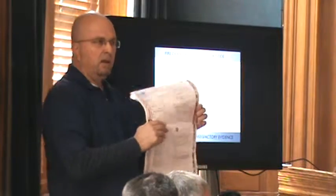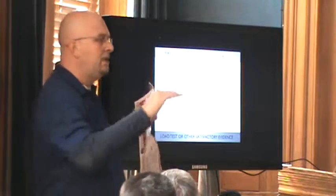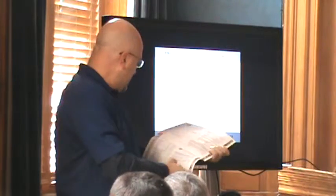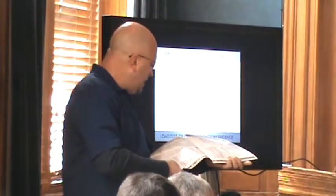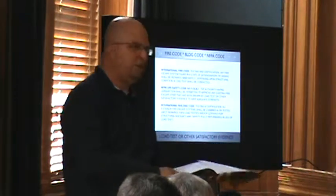The confidence test — everything is pretty simple. It's yes or no on every specific component of the fire escape, including the cantilever and the drop cantilever and the ladders. And also question number 19, which says: are the connections of the anchors into the building sufficient to support the required load as verified by methods acceptable to the structural engineer?